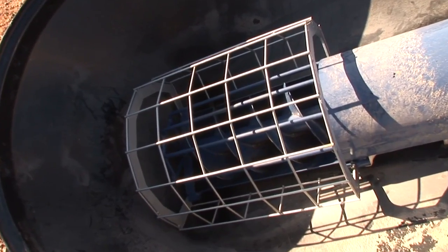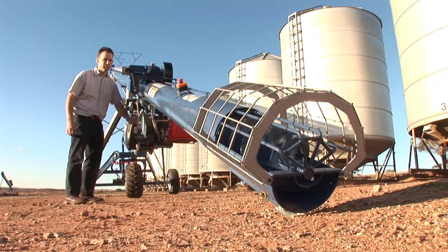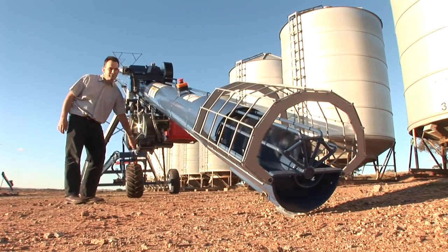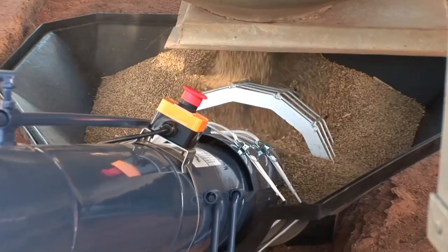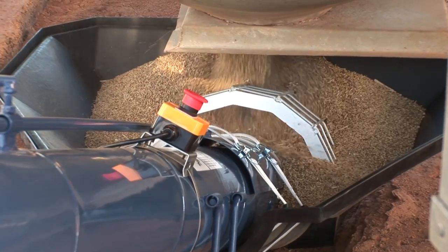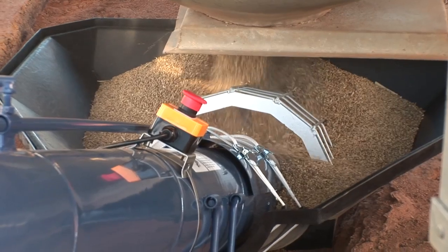Running through some of the features of the Grainline auger, we have the intake guard that conforms to the requirements of the Grain Auger Standards 2007. This incorporates a mandatory inner guard that is permanently fixed close to the flighting and an outer guard that is used when augering from a hopper but can be quickly removed if required to be put into a silo boot.